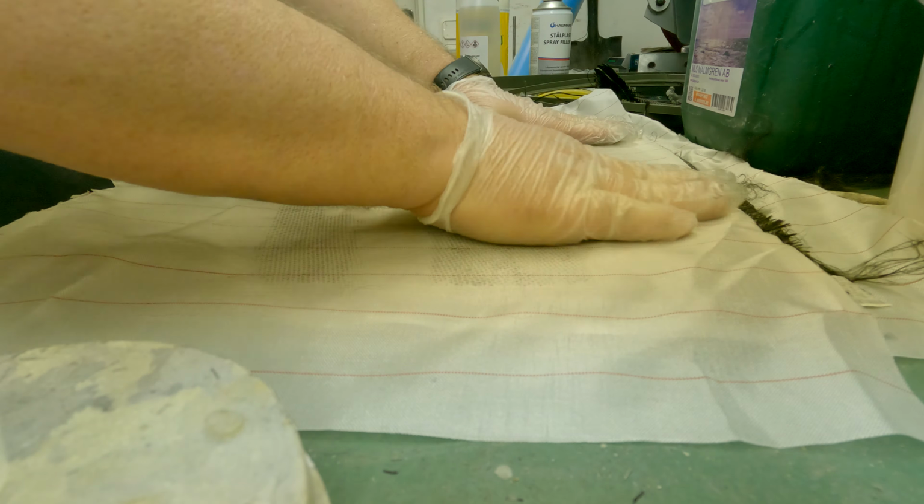So I glued in the stern, and it's got divinycell, only one layer of carbon, but turned out very nice and strong. Prototypes for the keel timbers. There's probably a better word for it. It's not made out of timber, but I'm printing these again, a little bit heavier, and they will be laminated in. And that usually looks like crap, to be honest with you. But I will try to do, this will be filled. I will make sure the keel is on straight, of course, and then these will be laminated in. Not these ones, but the ones I'm printing.